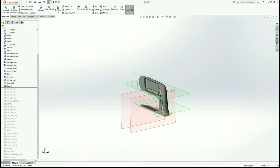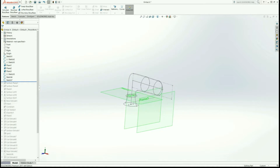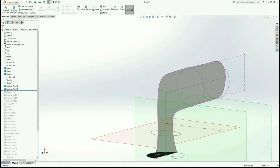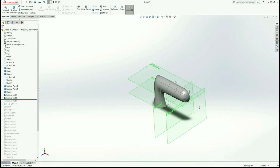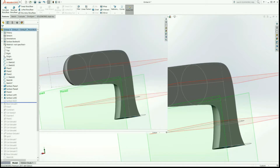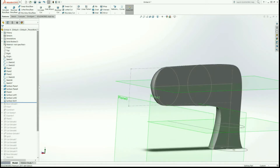Before I modeled anything, I created six sketches with three planes to define the overall shape, then created two surface lofts to get those flat pieces. I'm only designing half of this and then mirroring it over — there's no point doing the same thing twice. Those two surface lofts created the shape, and with a surface knit it becomes a solid body which I can then edit. I then created half of the battery box in this body.